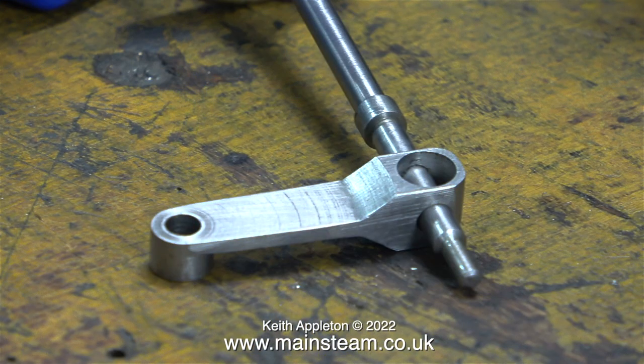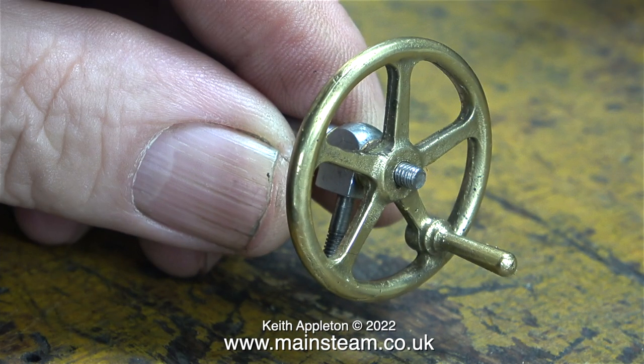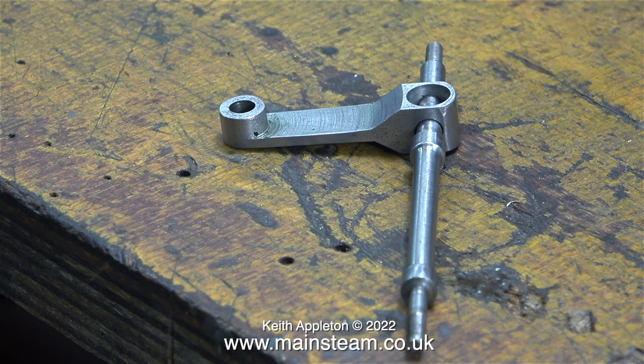This clip shows the part that the reversing screw is going to fit into — and this cannot possibly work; more about this later. I fitted this nice cast hand wheel to turn the reversing screw — I think it's a traction engine steering wheel off a mini traction engine, which is as its name suggests quite small. I re-threaded a really nice stainless steel metric dome nut or acorn nut for the end, and I've removed that now, which will allow me to thread the shaft in the lathe.